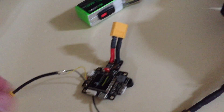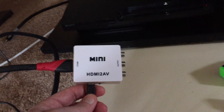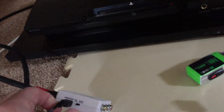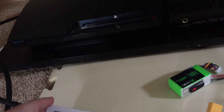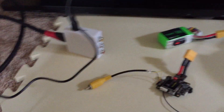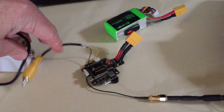Once you do that, you will apply power from a USB port from the computer — you can see this cable going to the back of the computer. This USB cable is included with the adapter; it goes right on the side and supplies power. I've got mine set on PAL right now. Most flight controllers out there will accept either PAL or NTSC. So that gets wired into or plugs into the box.